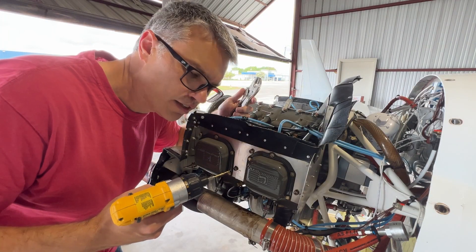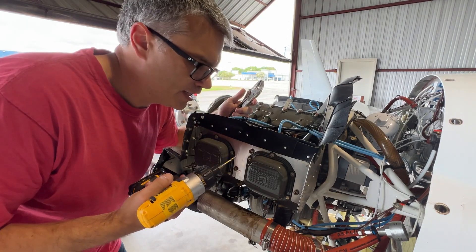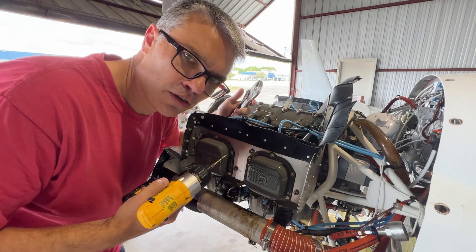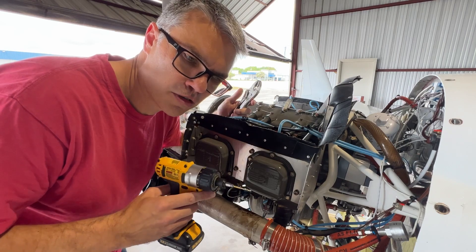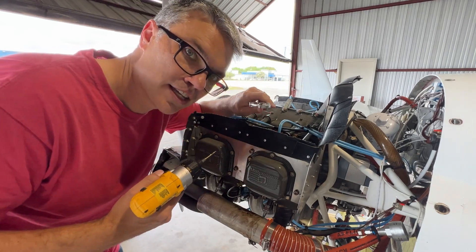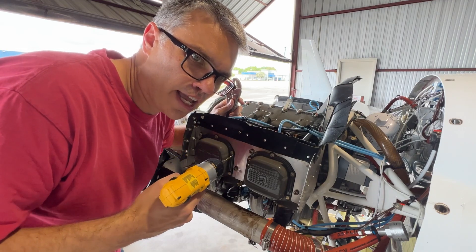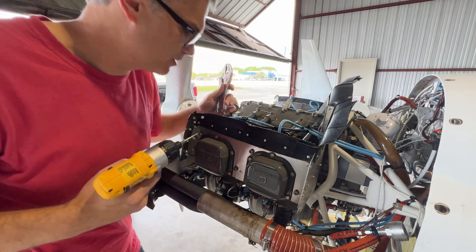This is connected with these eighth-inch aluminum pop rivets. I need to drill these out, and it's desirable not to make the hole any larger. So I think I'm going to use this eighth-inch drill bit and clamp the back side of the rivet, and then hopefully I can just sort of drill the head out without damaging the hole. We'll give that a shot and see how it goes.